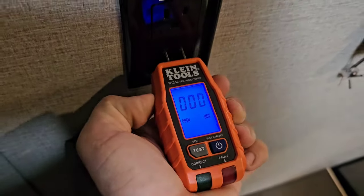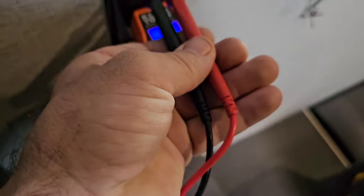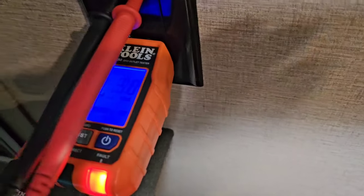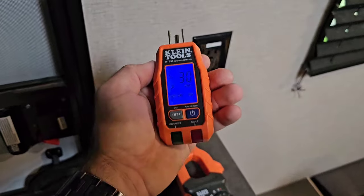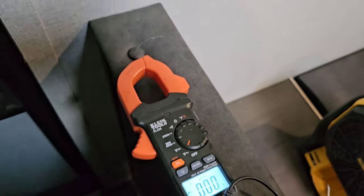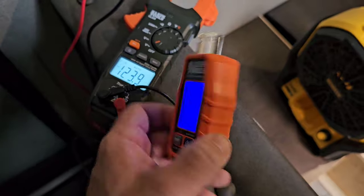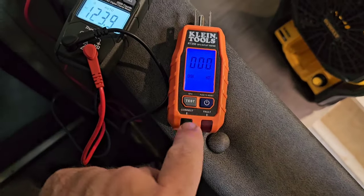So what's the actual problem? Why does this show 30 volts when it's clearly not? We can prove it's not 30 volts by this simple little test — it's putting out 123.9 volts, and yet it's still clearly showing 30 volts. The problem is this tester. I thought Klein Tools put out a good quality product, but apparently I was a little mistaken by this one. When this tool detects an open neutral, it automatically defaults to 30 volt hot ground reverse readings. I don't know why it does that, but thanks to some actual electricians in the comments troubleshooting with me, that's what we figured out.